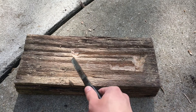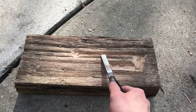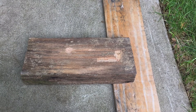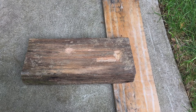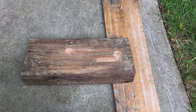I made some modifications to the second piece of wood to increase the chances of it working on the second test. Firstly, I ditched the two channels and I'm just going with a single thin channel, but I made it slightly wider and slightly deeper than in the first test. Also, I will be putting the wood at a slight incline so the molten metal can just flow down the carved channel. But let's get to it.